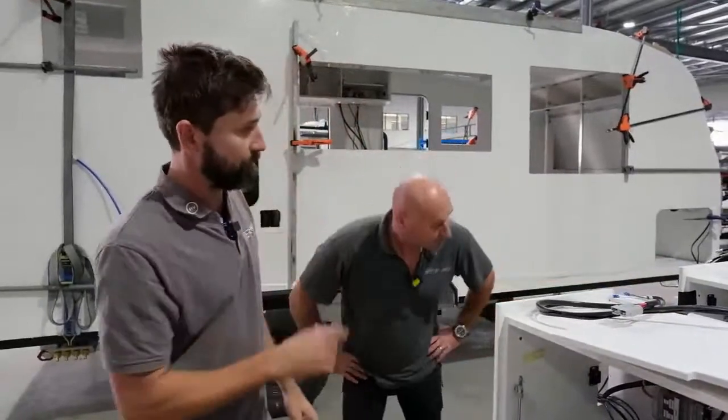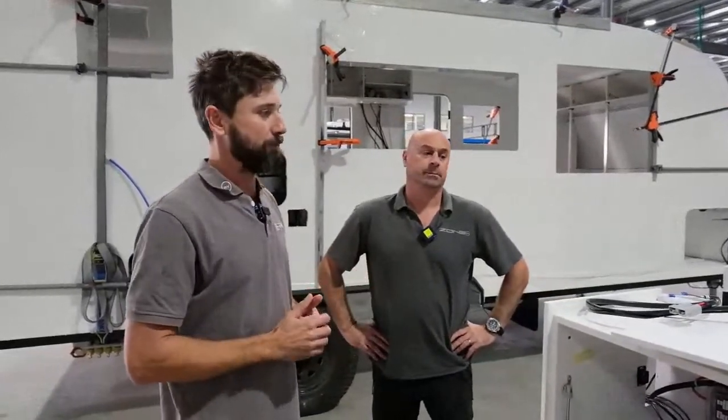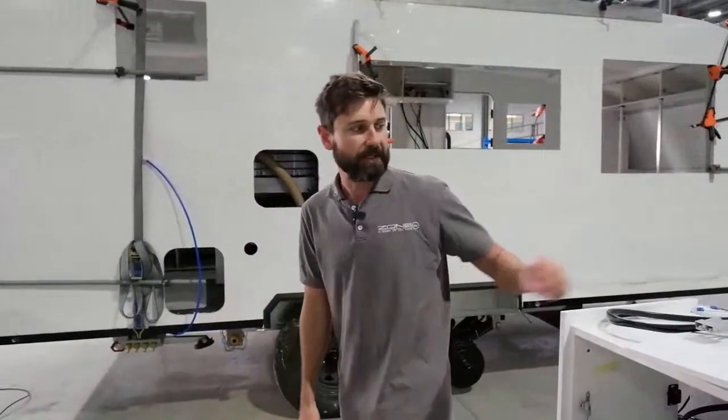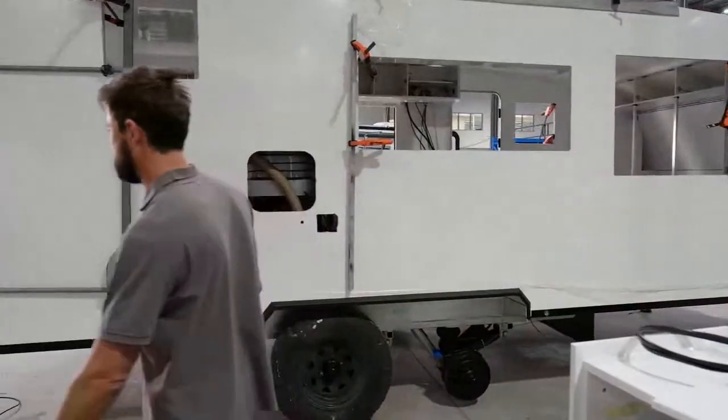So we obviously pay a huge premium to put a product like that in our van, but as anyone knows, in electrical systems, it's the key. If you are way out off grid, for a number of reasons, how are you losing power through your terminals? And the punishment that the harness systems and electrical system goes through in an off-road caravan, just getting absolutely shaken apart. You cannot afford to have bad terminations there that will let go over time.